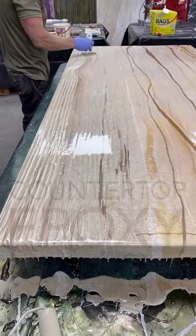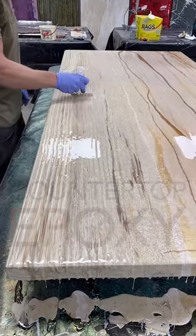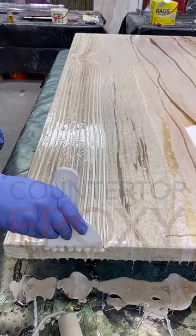I want to be a little bit random with the gold because I don't want the whole thing gold, but I do want some chopped in here nicely. Let's see if our graining and veining is a little better. You don't have to get it all done in one stroke — you can do lots and lots of strokes. Take as much time as you need to go back and spray more, and make lots of passes until you see that graining effect kind of popping out at you.